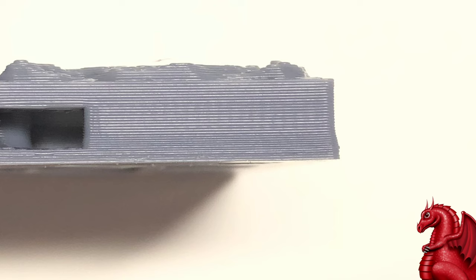So this can happen at any point. You could have the first 2 or 3 inches of a model look great and then have Z-axis binding because of an issue with the screw, or the screw being dirty, or the screw being bent or something like that. But we'll take a look here at some real easy fixes for Z-axis binding, and then finally at a part you can buy for your Ender 3 that will fix pretty much every issue with binding.